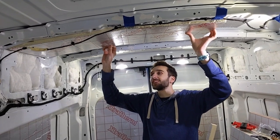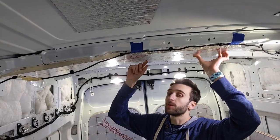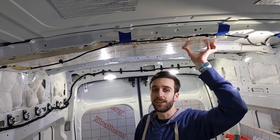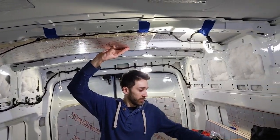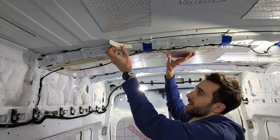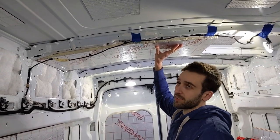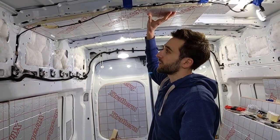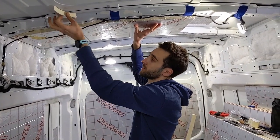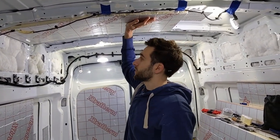We've got two panels up here on the ceiling to get an idea of how much height I'll have. Obviously the floor's not in at the moment, and there's going to be some ply probably here so I'm going to lose a bit of height. We spent a long time debating this morning whether we should use our 25mm or 50mm on the ceiling. The 25mm would fit perfectly and wouldn't require very much work, but it's obviously half the insulation. This is where we're going to lose the most heat. Once you've got the furring strips going down, it's going to be built up a little bit anyway, so we might as well put some extra insulation in that gap.